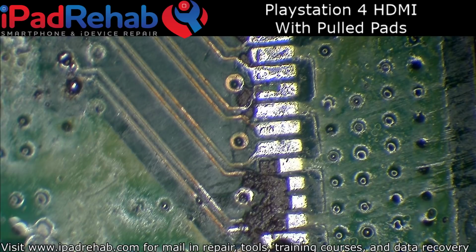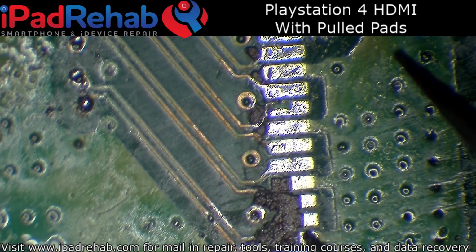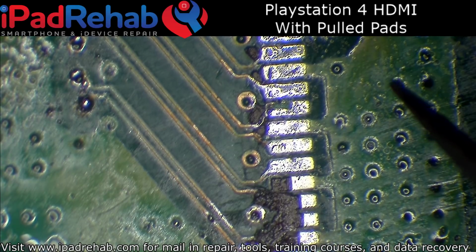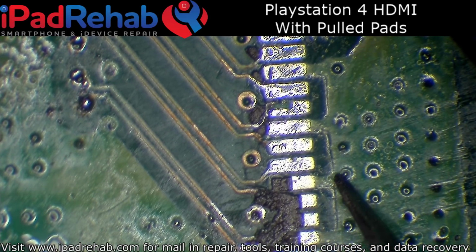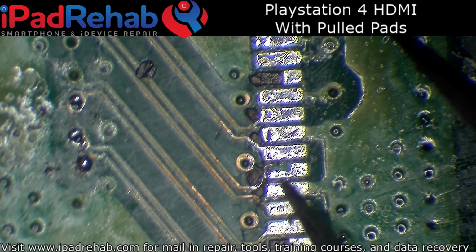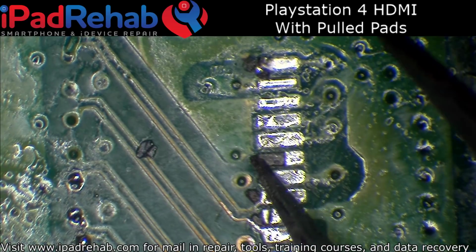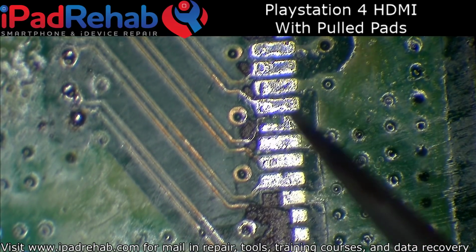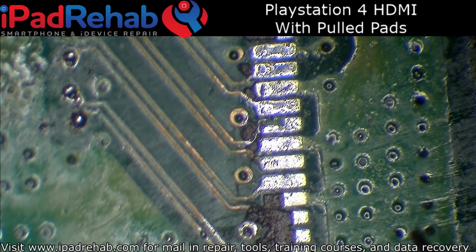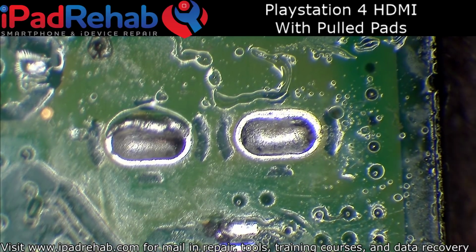So these are like data and clock lines, and this connects up to here, and then we have ground, and this pad connects there. And then this one connects here, and we have ground, and this one connects here, and it just goes like that all the way down. And then this one is NC, or not connected, so we can ignore that. So it's just going to take 1, 2, 3 jumpers, and we have to finish clearing out the old solder.